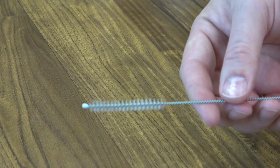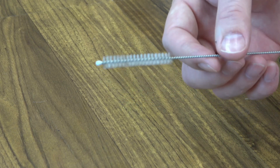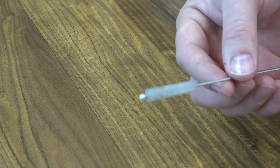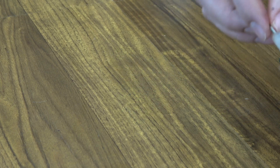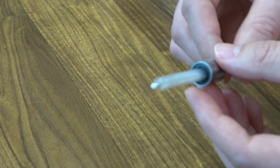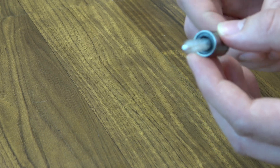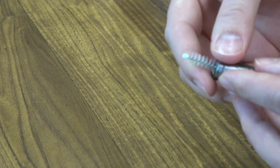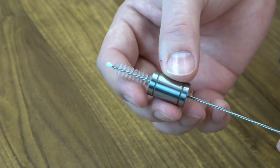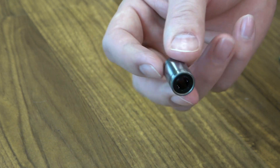The next thing I do is use one of these very soft 8mm brushes to run inside the bearing, to see what's going on in there and maybe clean out any debris or old lubricant — especially with the cheap bearings. You don't want to damage it at all, but these are soft enough. It gives you a good idea of what might be coming out of there. If the seal is deteriorating, it will show up on this brush. If there's nothing very obvious, we can move to the next step.